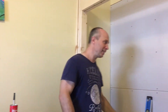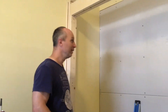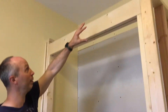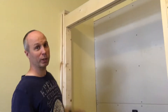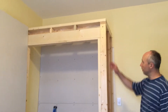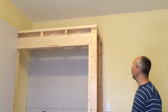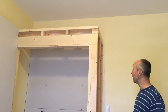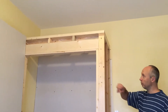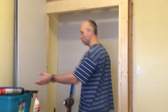I'm going to have no issues now despite the fact that I had a crooked wall from when it was built before. The next step is I'm going to frame in the top and then we're going to drywall it. At this point all the framing is done, all the studs are up. Now we're going to start putting on the drywall. I've already got a couple of pieces pre-cut.